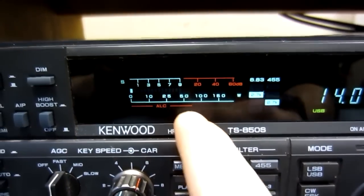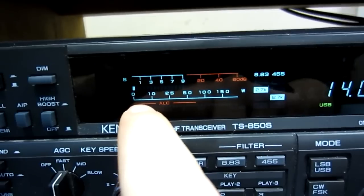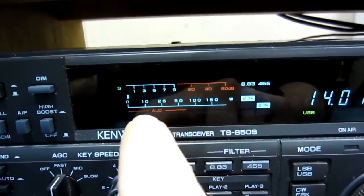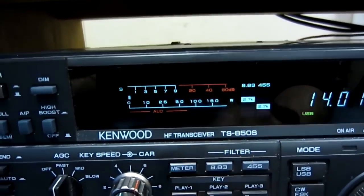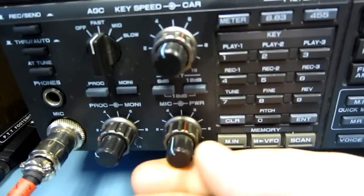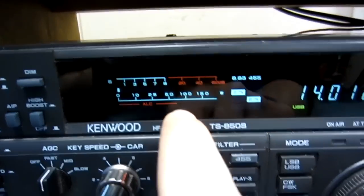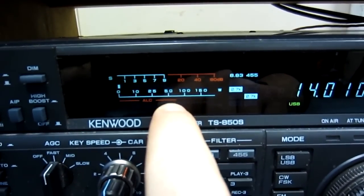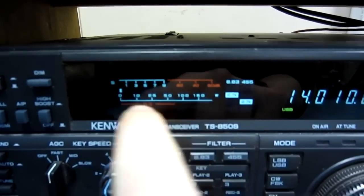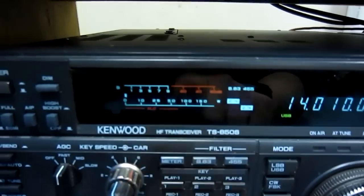You'll see that there's a little line here. This line is basically a pig pin. When you talk through the microphone, you'll see that this bar under it will fill up with white. What you want to do is change the microphone gain knob so that the highest that this meter reads is nowhere out of that pig pin there. So keep your audio within this line and you will have good sound, almost regardless of what your mic is.